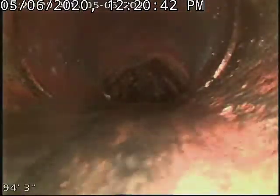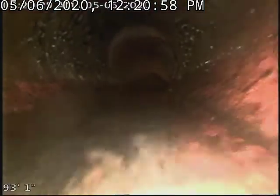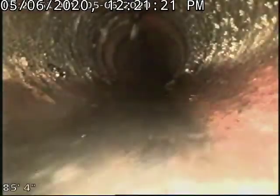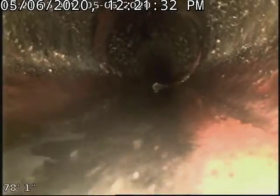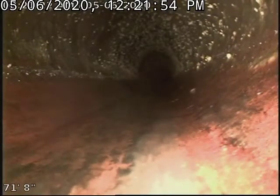A jetting could clean that out. Or is that a city issue — is that inside the city's pipe? You'll get a better look at it on the video. And we're going to pull back just so you can see. This is outside the crock — it's not perfect, but this looks pretty decent. Whether or not that one spot was a crack that I thought I saw in the video — I spoke about it. I may be right or I may be wrong. Notice the ring around the bathtub — it's telling me that this line has been backed up before, at least up to that much.